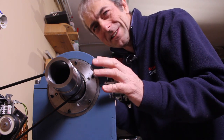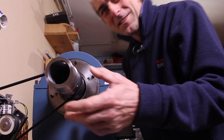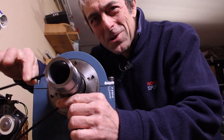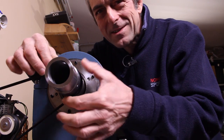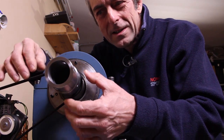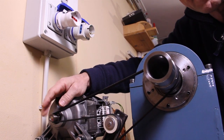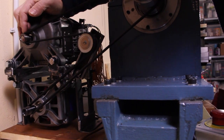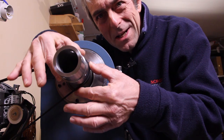So I've got to be a little bit creative to make the part that in turn will make the spindle spin. My first idea, my first step, is to use the belt directly on the shaft, and the belt is driven by this couple of motors coming from a washing machine. But this is just the first step, because the belt slips on the shaft obviously.